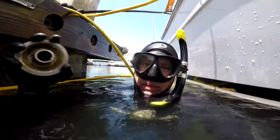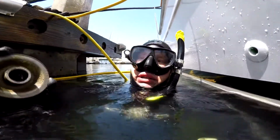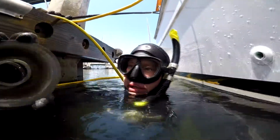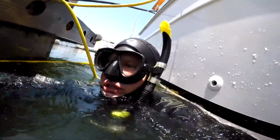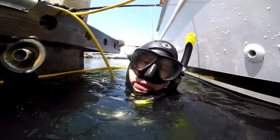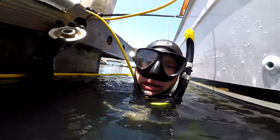The dog bone anode on this one has that problem with the starboard fastener at some point in the life of this boat. The fastener was over tightened and it broke off in the receiver hole, which is gonna have to be fixed someday.